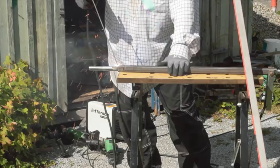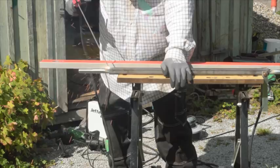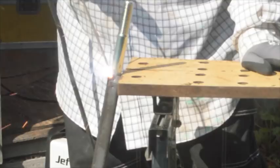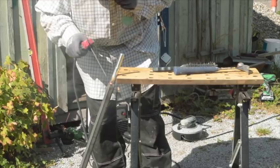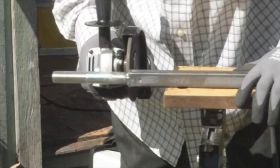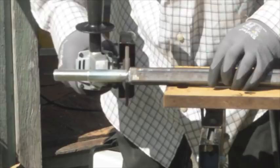Then just a dab of weld to hold the wheel studs. Check again, and then fill basically the corners of the box metal all around with a bead of weld. I didn't go totally over the top — there's no need. Just get a bit of penetration on each corner; it's not going to be carrying a lot of weight. Grind with a grinding wheel and tidy up just where the thing fits. There you go — lovely.